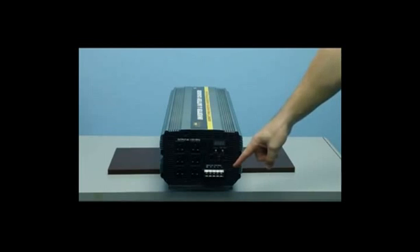This unit also features a hardwire kit. This hardwire kit will allow you to wire directly into your panel and allow you to charge and power your AC outlets on your inverter at all times, either by using utility power or battery power. This unit will auto-detect power outages and transfer automatically. When utility power is available, it will charge with the integrated battery charger.